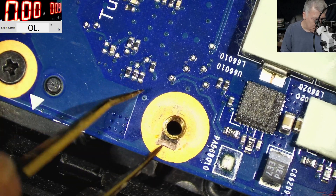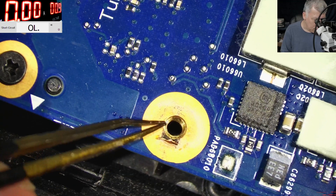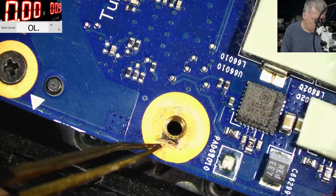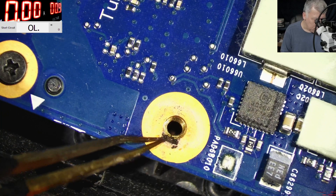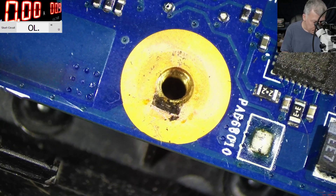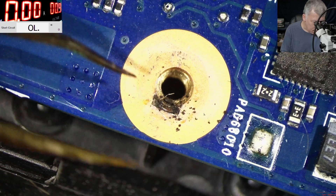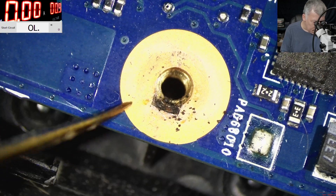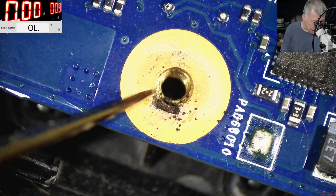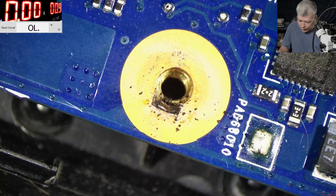What is here? What is this? It fell down. And this is a burned bore. So check here — there is a burned bore. You see? So that means this is ground. Clearly this is ground, and the plus track is coming here. Let's come with current and try to see if we can remove this short. But the odds are not very great. It's still short.